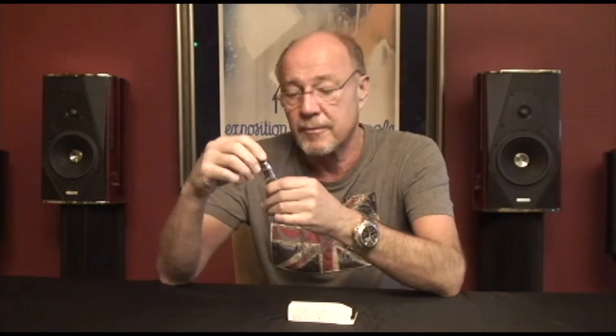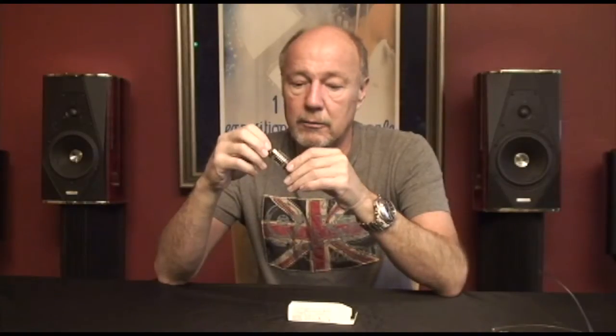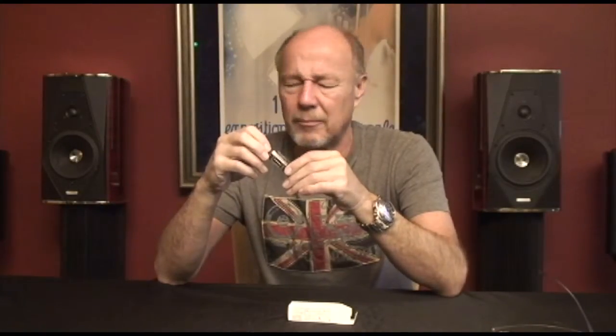It's got triple micas, low in microphony, low in noise — at least after we test them and kick out the ones that we don't want to sell. They last a long time. With a small signal tube you're going to get between five and ten thousand hours out of them. So it may seem expensive going in, but if you amortize it over the life of the tube, it's just pennies.